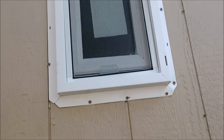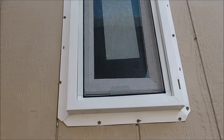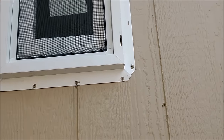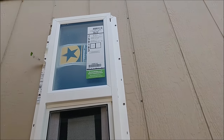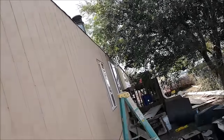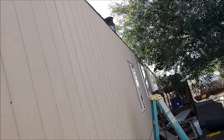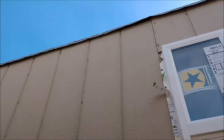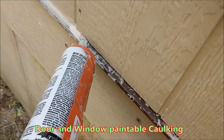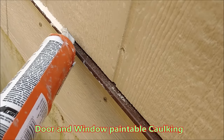The reason we put windows on the outside is you don't want to have to strip this whole thing to replace a window. We're in hail country — a lot of hail damage — so all I'd have to do is pop the trim off, pop the window out, pop a new one in, put trim back on. It's all going to get caulked and sealed. Now I'm getting ready to tie down the roof edge first, then put the gutter back up, using a different type of caulking for that.